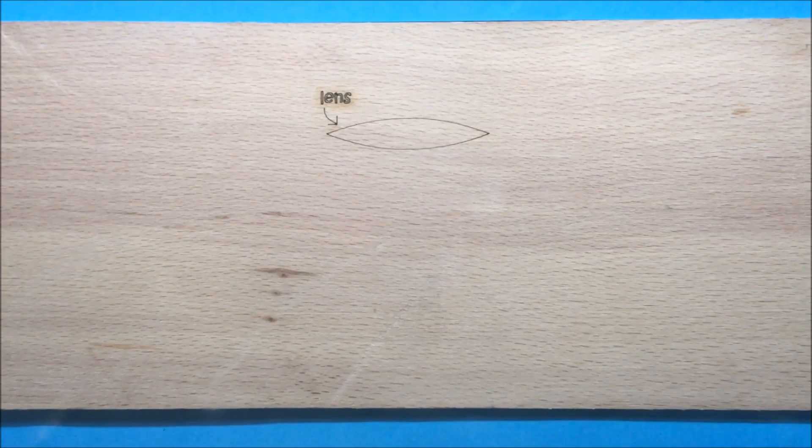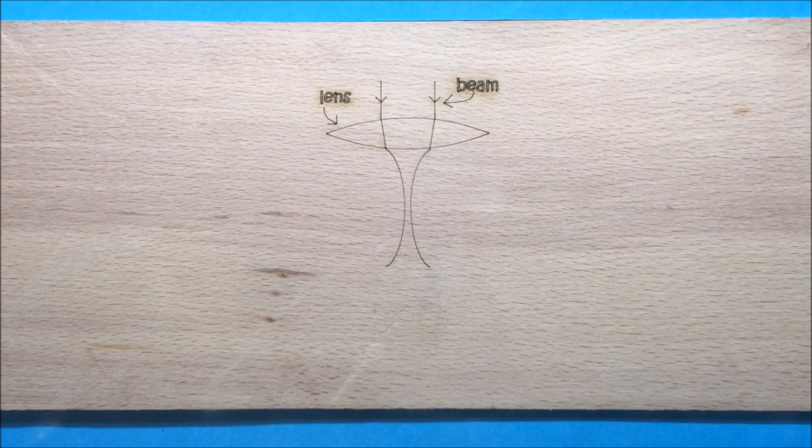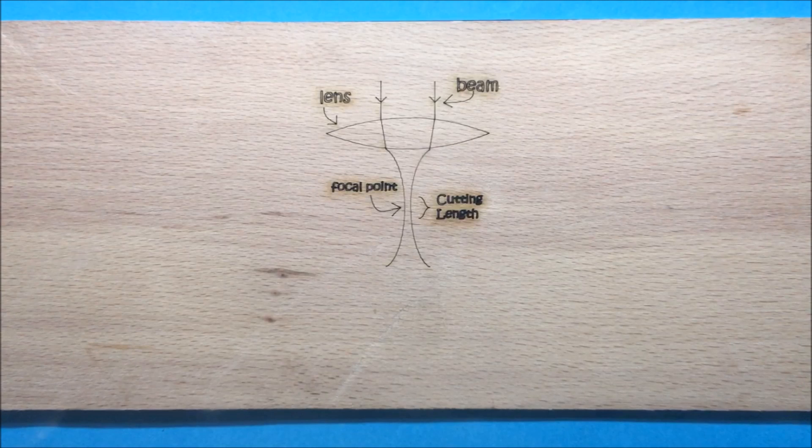Let's take a look at our final lens in our optical system and pass through it our aligned beam. Due to the profile of the beam entering the lens, it focuses to a small waist with a finite width. This waist also has a bit of distance in the top and bottom direction where it's more or less a similar width to the actual focal point in the centre. This region is what allows us to cut with some depth, so we're not limited to cutting just a single piece of paper.